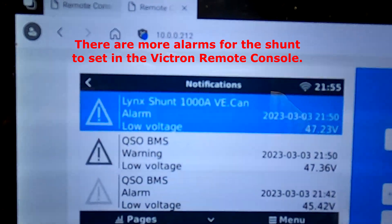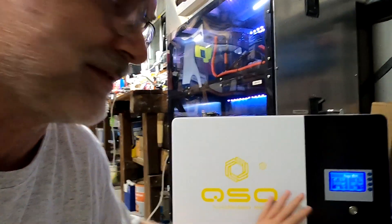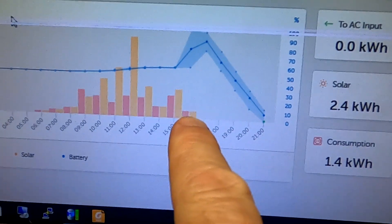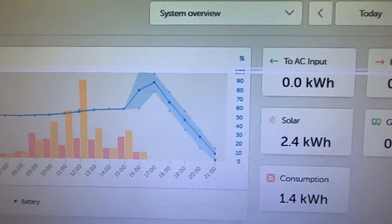That's it for today and tonight — capacity test on the QSO 230 Ah battery with a very good result. The BMS is working as designed, and I'm sure if we change the parameters accordingly we can make this battery work even better. Still, since we turned on the inverter, the Victron VRM shows the inverter power but doesn't calculate the DC load consumption — another mystery. Thanks so much for watching, thanks for all your great support, and welcome to all the new channel members. Stay charged, stay safe — see you next time.